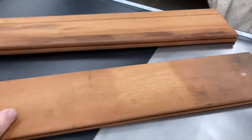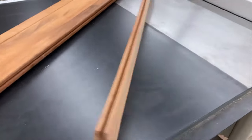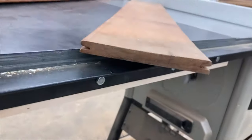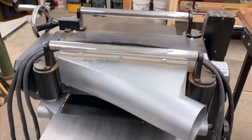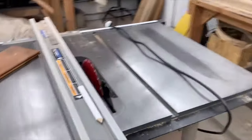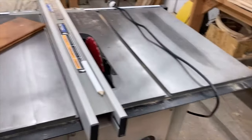and it's nice and flat. It doesn't rock anymore. I've taken all the twist out of it. As you can see, there's no twist. So I want to get this down to about 3/16, a little more than that most probably, 3/16 or a touch more. And I'll either do that on the thickness planer, or I may do it, and I'll end up with some remnants, by cutting it to that thickness on the table saw after I cut it into like 1¼-inch wide strips.